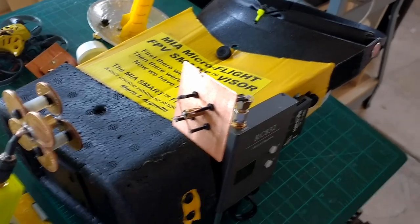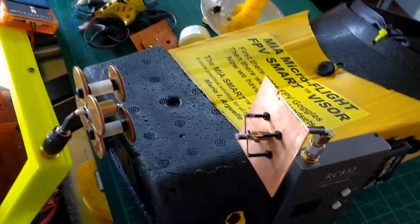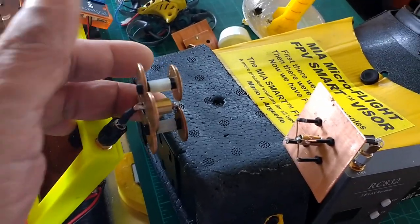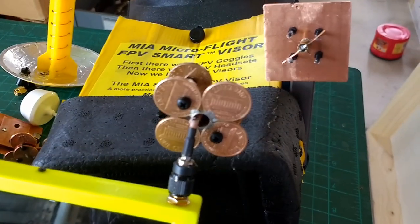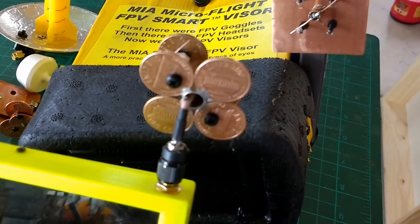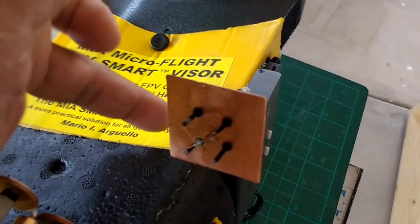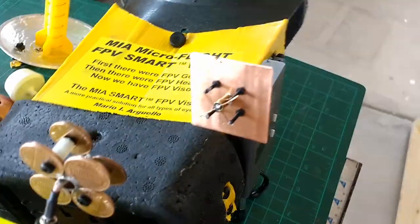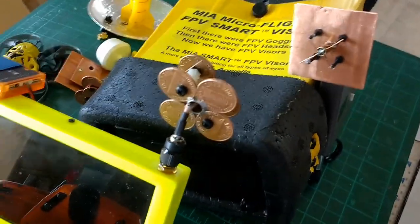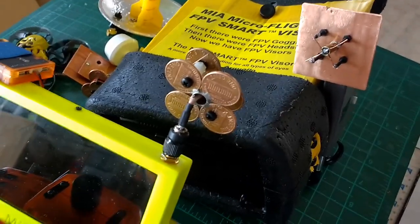Look into electronics once again, books or information, to find out how baluns work. On this one, I made mine at 5/16 versus 3/16 that I use for this one here. And I used a 5/16 outside diameter brass tube by 1/2 inch. Remember, these wires were coming out at 1/2 inch for me on the longer side and 0.4 inches on the shorter side. That figure, I'll talk a little bit more about in another part of the video.